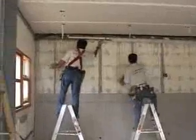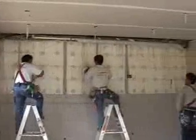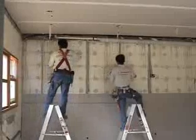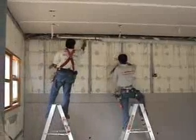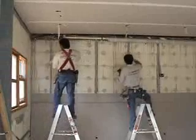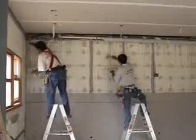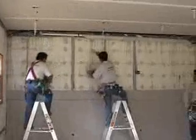As you said, it doesn't take too long to put the corner cement on there. Stud adhesive can be used too. The only problem with stud adhesive is it does take a little bit longer to dry, whereas the corner cement dries very quickly, so it allows you to put the next sheet on there without the first sheet moving, particularly when you're lining up the recessed edges.